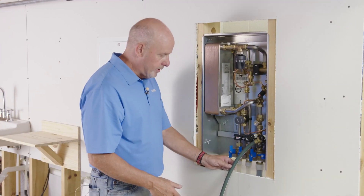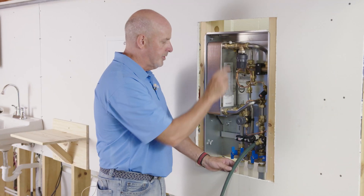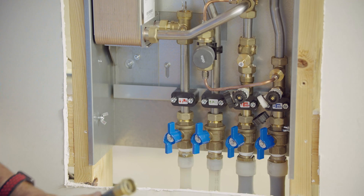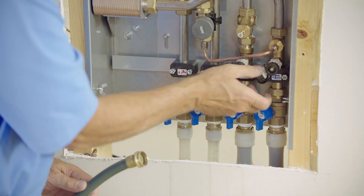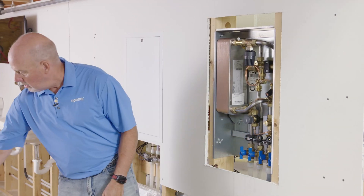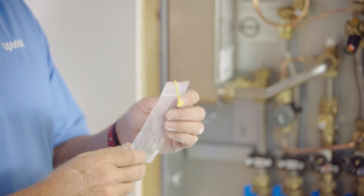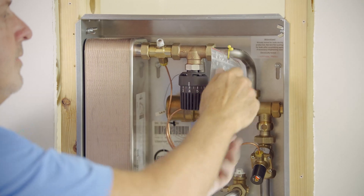Once we have a steady stream of water in the bucket, close the valve, make sure the vents are closed, remove the drain line, and open up the hydronic return line — the port is ready for operation. There's also a bag that comes with the AquaPort containing spare screens and flow restrictors if needed. Make sure you install the flow restrictor on the return line of the heating hydronic water.